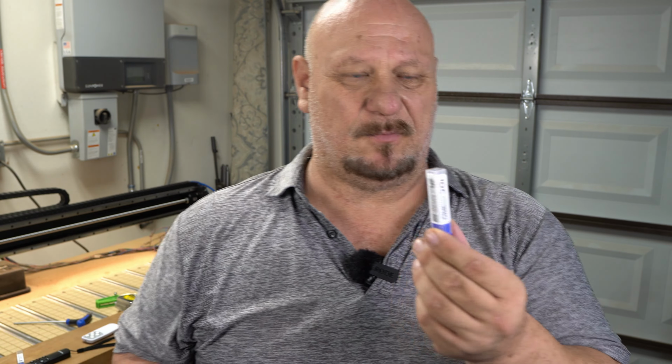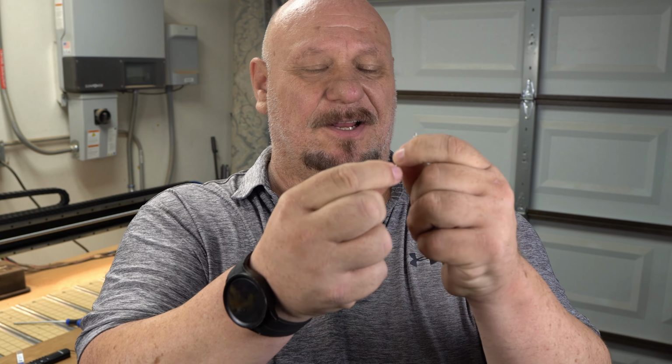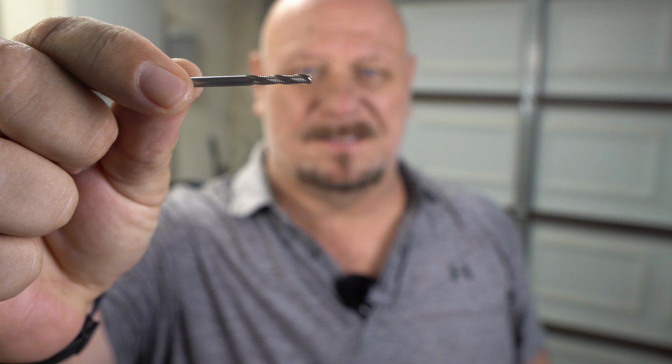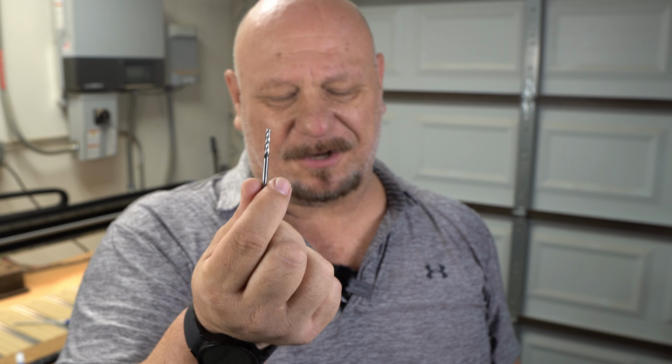And we'll finish off today with the Badger. This is just a little 1/8 of an inch bit, really tiny. But as you can see, it's got the same properties of the HOG. We're going to go 1/4 of an inch depth, 130 inches per minute with this bit.